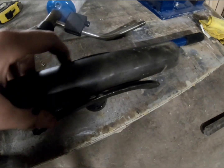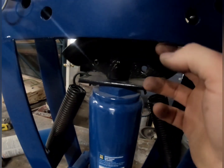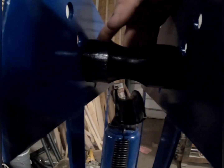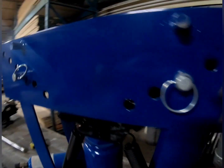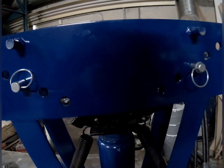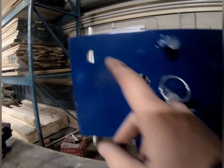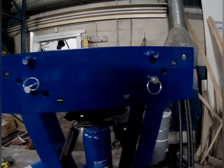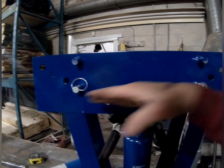It does work and it works every time. I also add sand into my pipes so the sand is actually pushing on each side of the wall when it's bending, holding the circular shape rather than it folding flat or kinking. I put my die into the press — it just clips on — and it has different spots where you can put the rollers to bend your pipe. The closer you go to the center the quicker and harsher the bend; the further out the more gradual. I keep them at three positions up from the tightest.